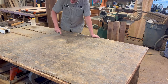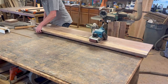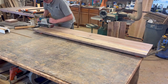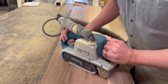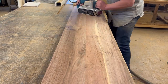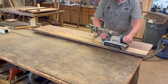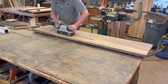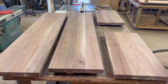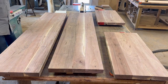This is the next day. I'm going to get the dried-up glue off my workbench and off the panel, then use a belt sander to clean up the remaining glue and any inconsistencies in the glue-up. For me it seems like it's a lot more aggressive sanding across the grain, so I sand across the grain but at the end you've got to come back and sand straight, because it'll scratch it up pretty good sanding across the grain. So I make one more final pass with the grain.